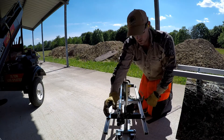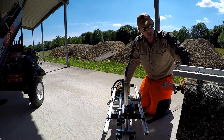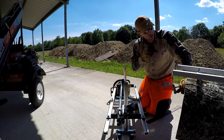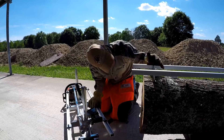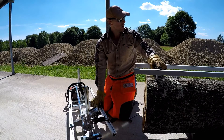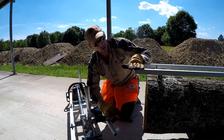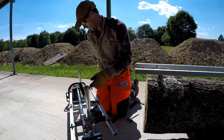Okay, I've got that all tightened — set at five inches — that should get me down in this log good enough to where I'll have a pretty good board. Probably most of the way will be about four inches; it kind of gets narrow here in the center, so we're gonna see. I'm gonna have a problem — it looks like these right here are sticking up, I may have to start over on this rail. Also need to let this rail stick out so you can get the chainsaw mill on it — I'm not sure how that's gonna work.